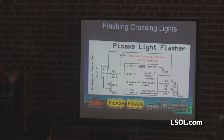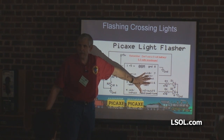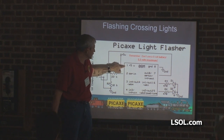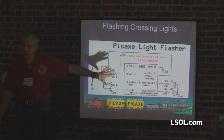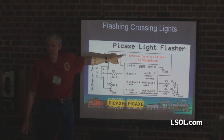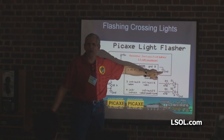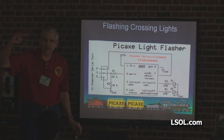That is a schematic — you see those whenever you install a sound card. That little chip we're passing around is shown here with its eight pins. Remember the notch? The notch is right up here, and when you count pins on a chip, you find the notch and count counter-clockwise from it — so that's pin one, two, three, four, five, six, seven, eight. You connect pin one to positive voltage — whatever you're giving it that's less than 5.5 volts. You connect pin eight to ground, which is the negative battery connection. Pin one goes to the red wire, pin eight goes to the black wire.